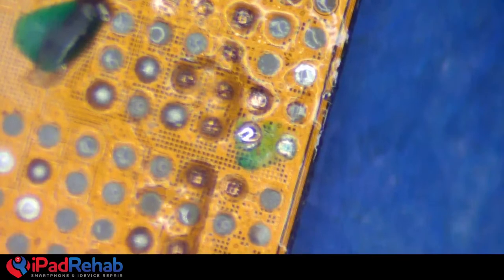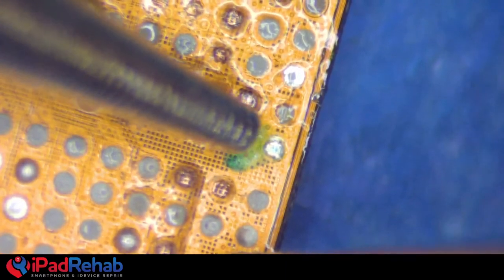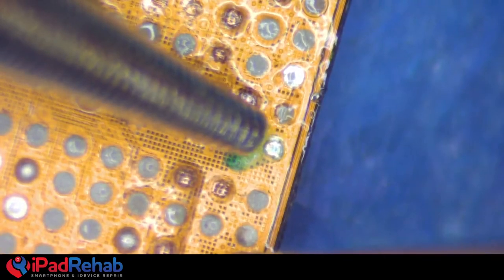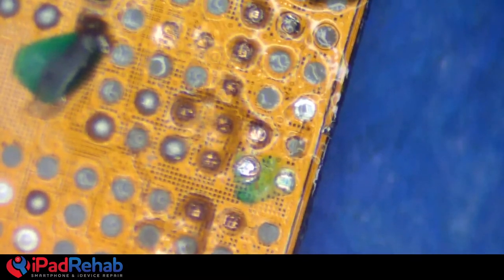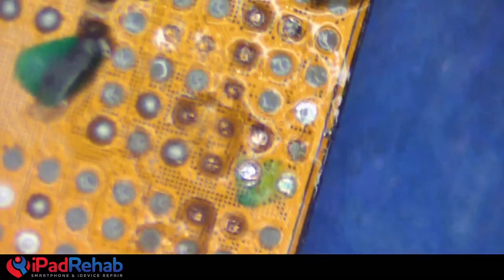All right, now let's see if we have a diode mode reading and not a short to ground. Okay, there we are. Yeah, 300, which is what it was before. The ball, I measured 270, but that was the ball above it that was throwing me off. That's why I knocked it off. All right, so very good. That looks pretty normal.